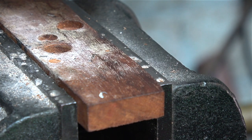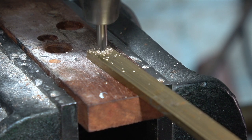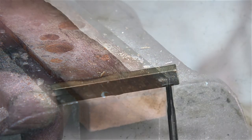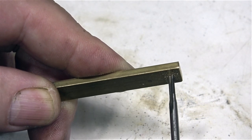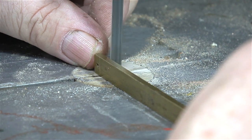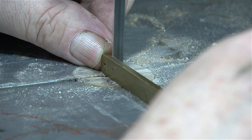I'm using this centre drill — off-centre as it may be — to make a hole in the work. Once I drilled this pilot hole with the wobbly centre drill, I then changed that for a twist drill which is tapping size for 7BA, and this was a lot steadier. The next part of the job is to thread the piece of bar 7BA using a 7BA tap, keeping the tap as square as possible to the work. Now the hole is drilled and threaded, it's time to cut off the end part using the bandsaw — my fingers are fairly close but far enough away not to cause personal injury.